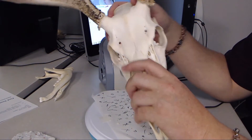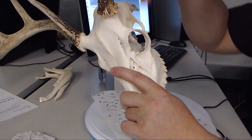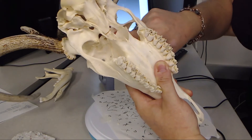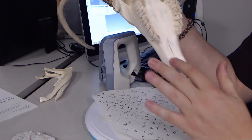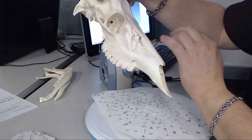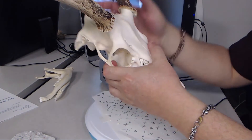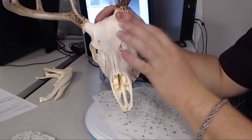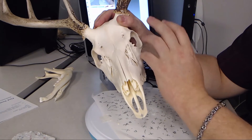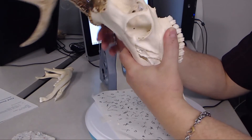This skull provides several different challenges. The skull itself is not going to be that hard except for the orbital sockets — these cavities are going to be difficult to get down inside, so we'll have to hit them from several different angles. If surfaces have a lot of variation in terms of geometry or texture, they're going to scan very easily, because the scanner takes pictures as it scans, and what it sees from one frame to the next helps it correlate where that data belongs in relation to the rest of the model.